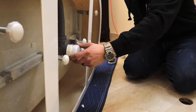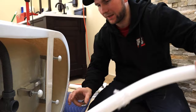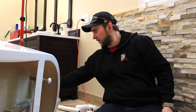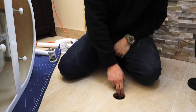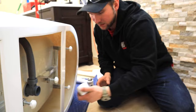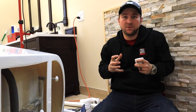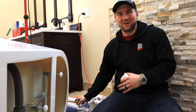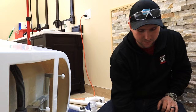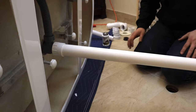You attach the p-trap here, which allows you to put the drain hole anywhere under your tub, and then it goes down into the p-trap or drain downstairs. We were lucky — once we set the tub where we wanted it, there were no floor joists in the way, so I'm going to hard-plumb right into the p-trap. I'm going to foam around the drain pipe from the bottom to add a lot of strength and anchor the tub so it doesn't shift. For the assembly, this piece goes here, this piece goes here, and everything else goes into the basement — just like a regular bathtub with a p-trap.